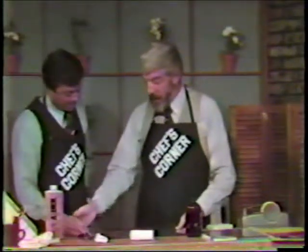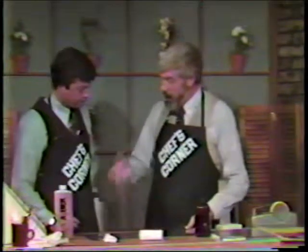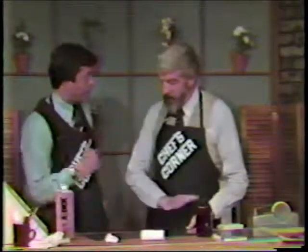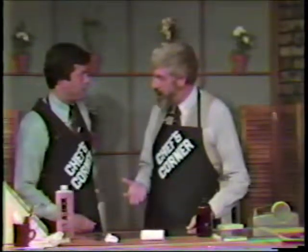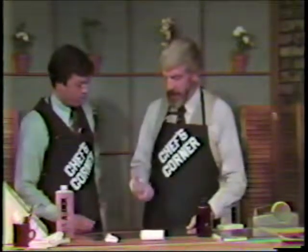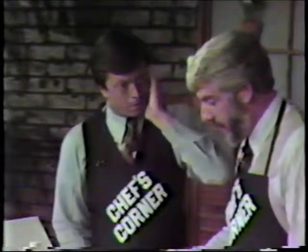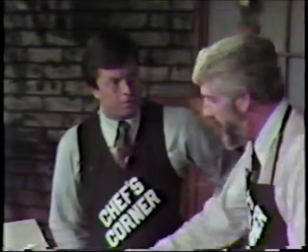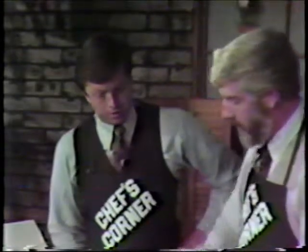Okay. Also, if you're going to use both sides of the plates, you should image them all at the same time. Not wait. You can't process one and then go back and image the other side of it. You must image both sides at one time. And if you were to do that, then you would be advised to process it, say, on some newspaper, where it sets into the surface and doesn't move around. It would be better to do that than to do it on a stainless steel plate sink where it would move around and maybe scratch the image. Sure. So it would be better off to do it that way.